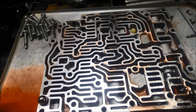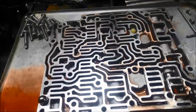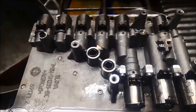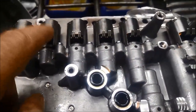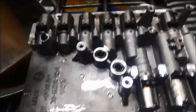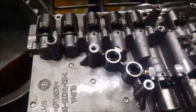If those plastic clips are worn you'll find really fine plastic right through the whole valve body. We'll just put this back together. Just make sure you don't bend these little contact pressure points down too much — and if you do, just straighten them out. It's also a good idea since we've been working on them to give them another ohms test and just check the resistance is still there.